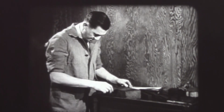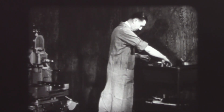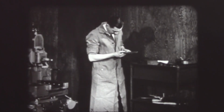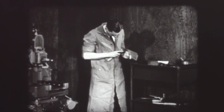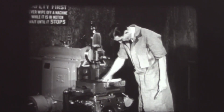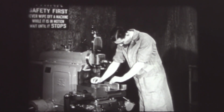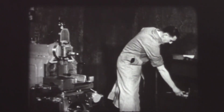The opening between the two vice jaws must be slightly greater than the width of the piece, plus the thickness of the two brass liners. The brass liners must be free of burrs or bruises, and the vise must always be clean. The liners are used in this case to protect the vise jaws against scratches from the rough casting.